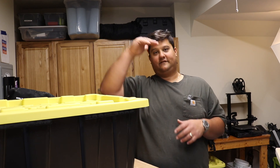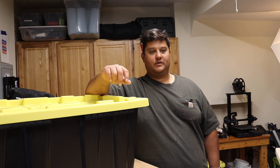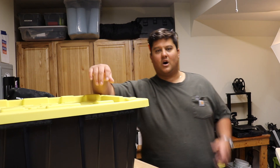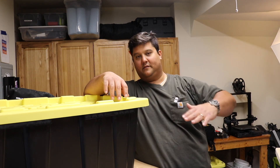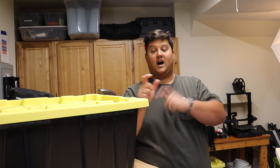We'll have two racks, five bins each. I'm thinking there's going to be about two and a half inches between each bin, which I think will give us enough room to pull them out. This is the design you've seen all over the internet. We will frame what is effectively two walls — the same way you'd frame a wall — with a top plate, a bottom plate, studs on either side, and one right in the center. That'll give us two columns.